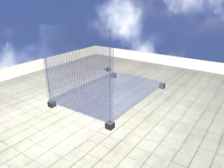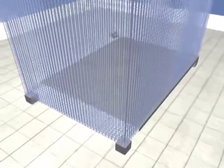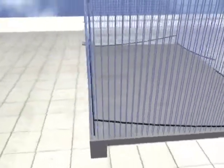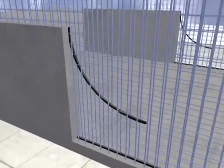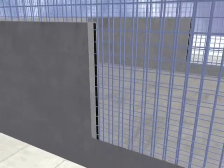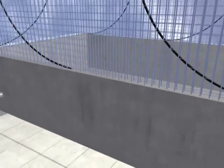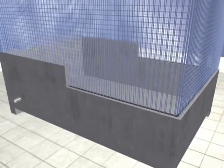In a concrete water tank also, Dr. Fix-It water bar should be used for the joint between the slab and the walls. If there are vertical joints between successive pours, they should also be sealed with water bar. Successive lifts of the wall should also be sealed using water bar.